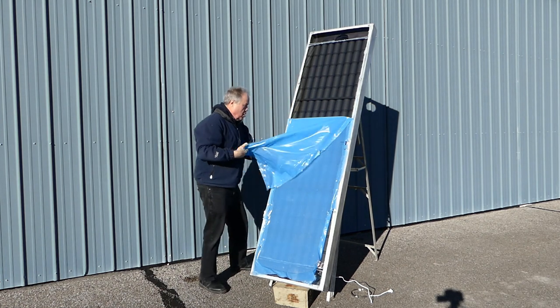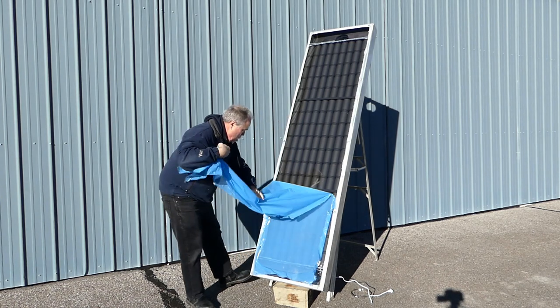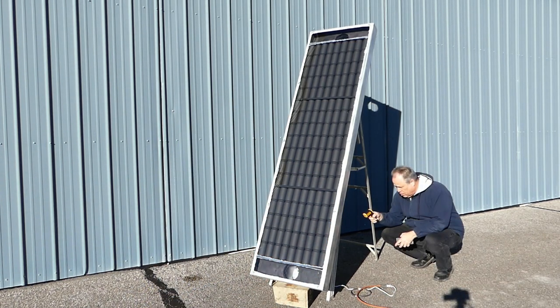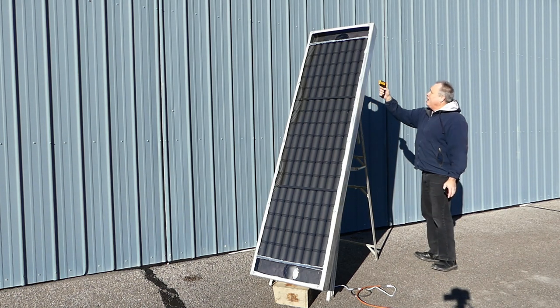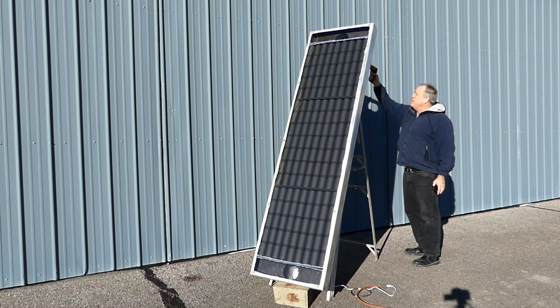In part one, I shared that using calculations provided online, at 12 noon on a sunny winter day at 45 degrees north, my design should produce 4,600 to 5,000 BTUs, somewhere between 1,350 and 1,460 watts. That statement was theoretical and calculated using ideal circumstances. This panel isn't perfect, likely loses some heat, isn't pointed exactly at the sun. Let's see what it really does.